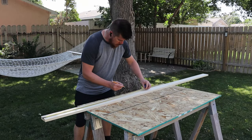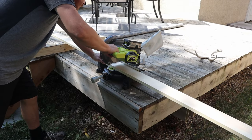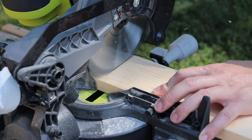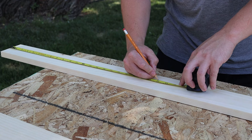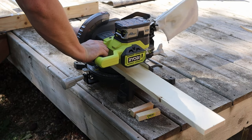After cutting a little bit off of each end of the boards just to get nice fresh wood — because it's usually kind of beaten up after sitting in the racks — we can start measuring and cutting everything to length. For my cornhole boards I'm shooting to have about a quarter-inch overhang of the top to the frame; this isn't necessary, I just like the way it looks. After that I'm going to have four cross braces running throughout the center, and the entire thing is going to be pocket-hole screwed together for simplicity.